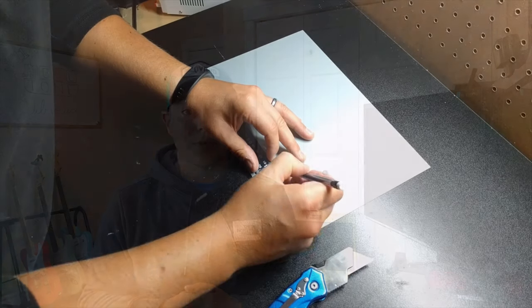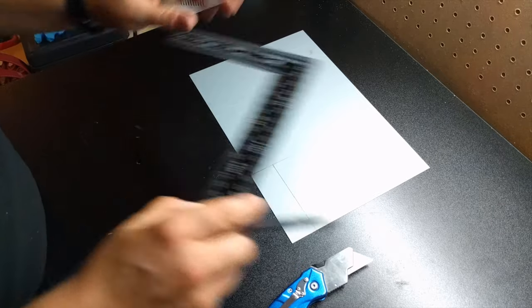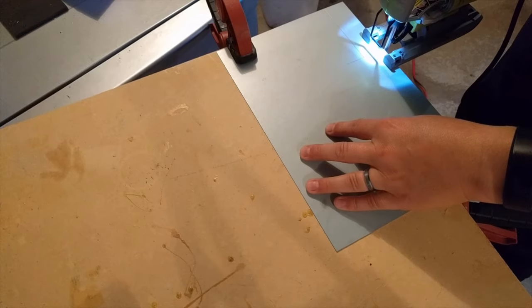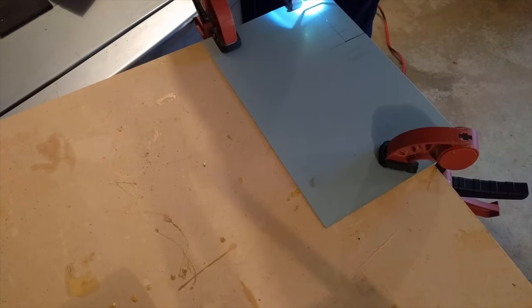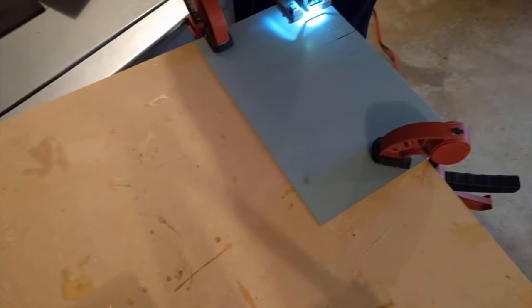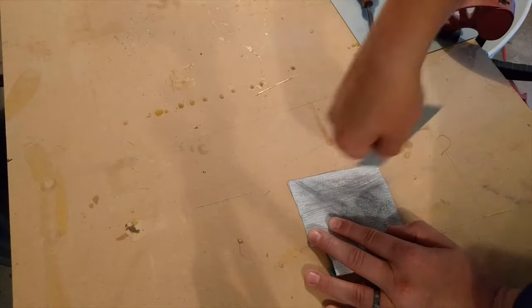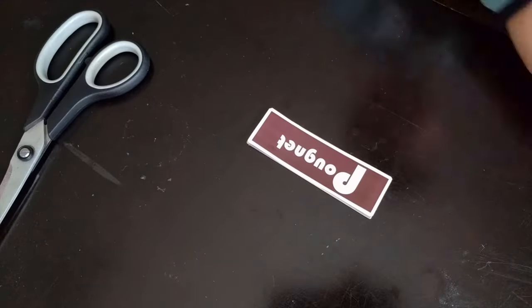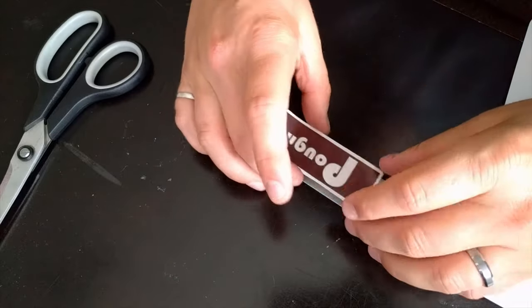The only thing left to do was to go ahead and build out that amplifier badge that you see on there. I do have a little bit of video of that. It was a pretty simple process, to be honest. I went to my local hardware store, picked up some sheet metal, same stuff they use when repairing automobiles. I cut out a small rectangle from that with my jigsaw. I shined up the sheet metal with some sandpaper and steel wool, also cleaned up all the rough edges from sawing it out, and then used the same process that I do when creating graphics for my effects pedals to put my Pugne icon on the front of it.